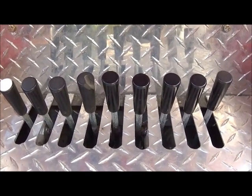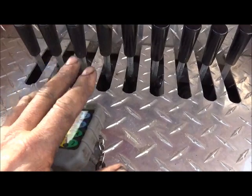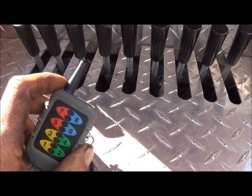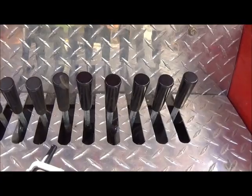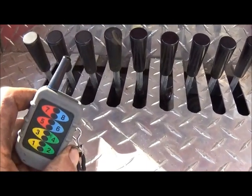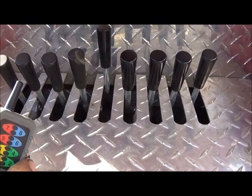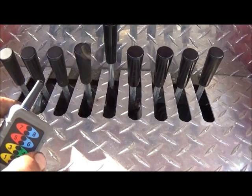We may do some of the outriggers too. When you buy these units — like I said, this is an eight-function, so that's only going to run four control valves. You can get a 15-function which would run seven control valves with one extra. They don't offer them in even increments, which is a little weird. There are two different styles: a momentary function, where when you hit the button and let off it comes back, and a locking function, where you hit the button and it stays locked.